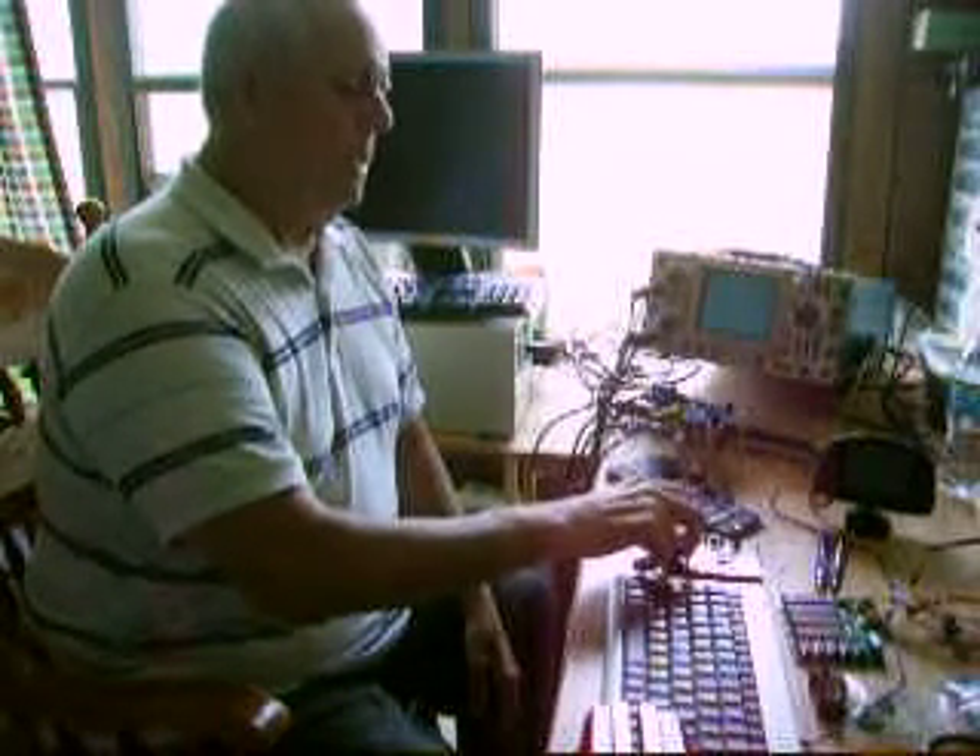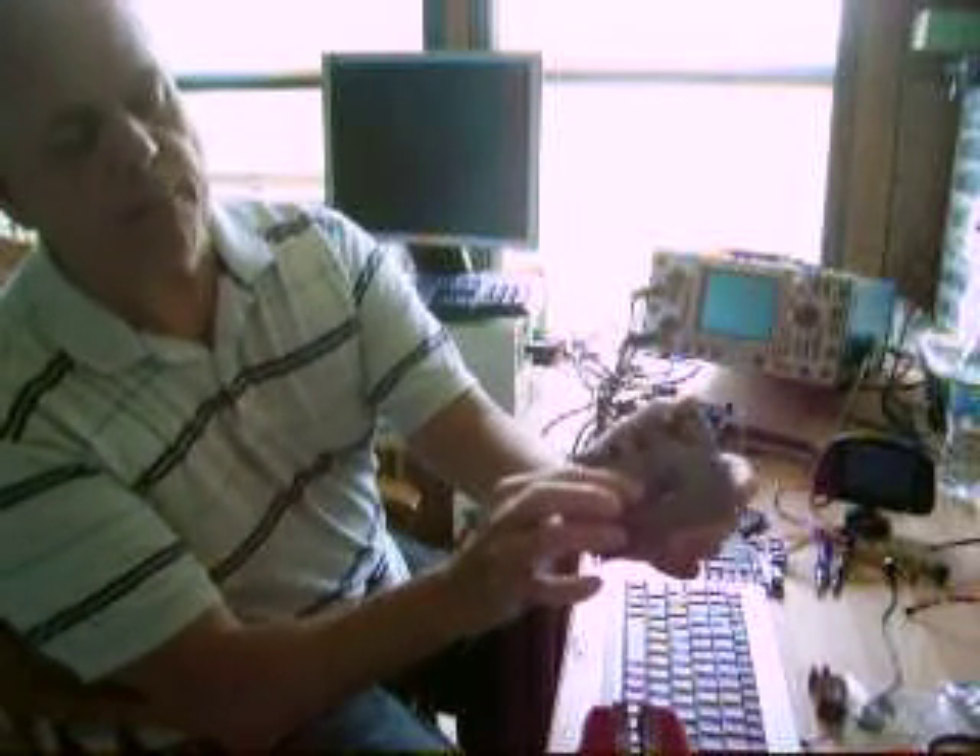The next board we have designed is the memory board. I used these DIP-size devices because most people do not have either the soldering skill or the appropriate tools to solder surface-mount devices — it's just not possible for the wider public I'm trying to address. I want everyone who wants to to be able to do this on a kitchen table. That's the reason for the DIPs. I also socket everything, which makes it easy to repair the board. If a chip burns out, you just pull it out of the socket and put in a new chip, instead of usually destroying the board trying to replace a large chip.